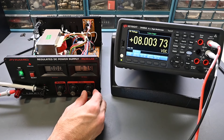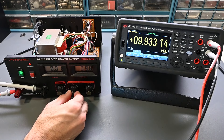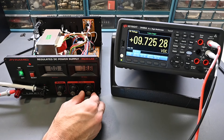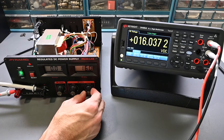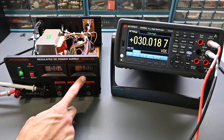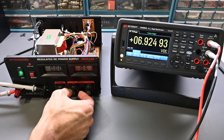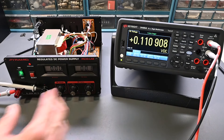Starting to increase the output voltage: at 7.9V setting, 7.9V output — very good. At 10V setting, 10V output — matches perfectly. There's a click for the relay as it switches to the higher voltage range on the transformer. At 16V, 16V — matching very good. At 21.3V setting, 21.2V output — very, very close. All the way up to maximum: 30V setting, 30V output — perfect. The maximum output of this power supply is supposed to be 30 volts, and it achieved that with no problems.